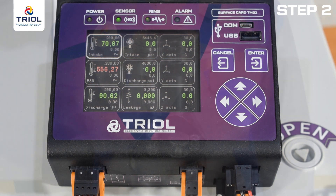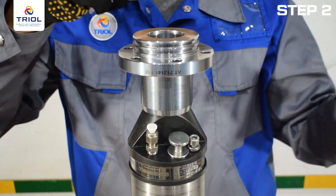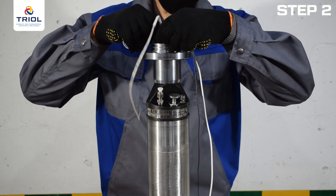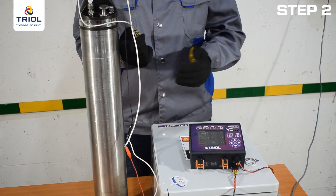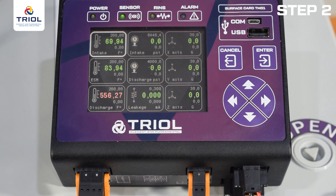Take the remote submersible motor oil temperature sensor in your hand and squeeze — the warmth of your hand will warm it up, confirming the submersible unit is transmitting measured data to the surface card. To test the submersible motor oil temperature sensing channel, connect the connectors of the external oil temperature sensor to the plugs — during installation you should hear a distinctive click sound. Switch on the surface card and check the readings. When receiving data, the readings for the submersible electric motor oil temperature turn green, while the temperature at the pump outlet is highlighted in red. Lower unit testing is now completed.